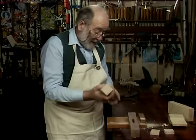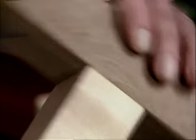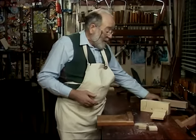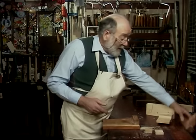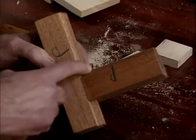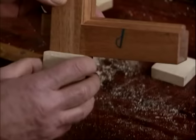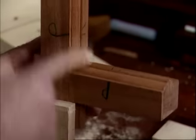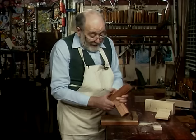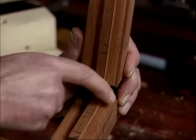I've enjoyed making joints all my working life and I'm a little bit impatient to get to the point where you put them together to see if they fit. Of course, they don't always, do they? We've come to the moment of truth — will it go together? There we are — we've got a reasonable fit, a through mortise. But things are not that simple. Here we've got a joint — a mortise and tenon — but it's got an ovolo moulding and also a rebate on the back. This would be the glass rebate in a sash. We've had to accommodate a rebate and a moulding: we've scribed this shoulder to fit over the moulding, and this shoulder is long enough to go down and fit in the rebate.